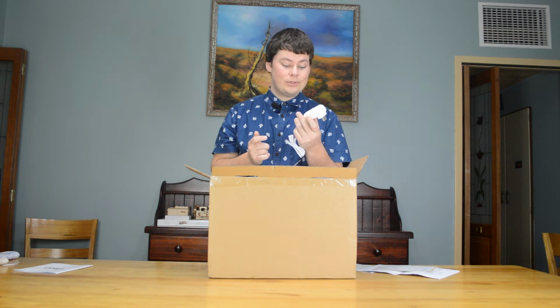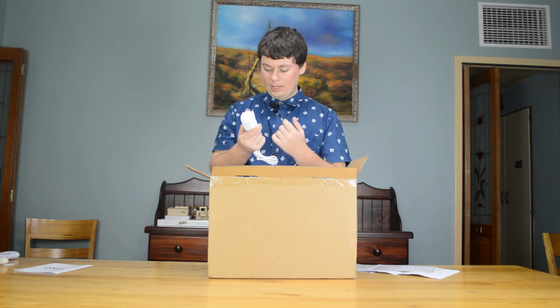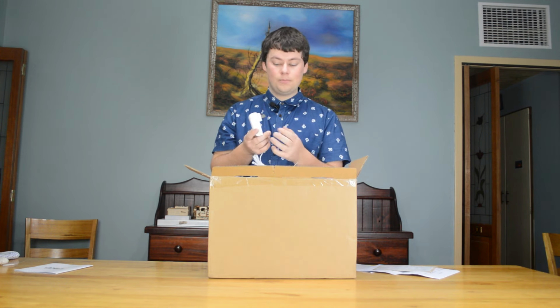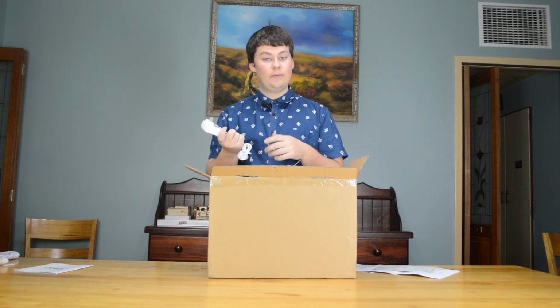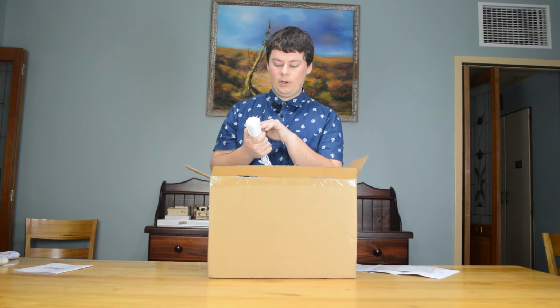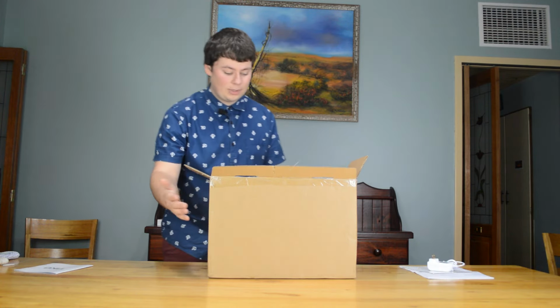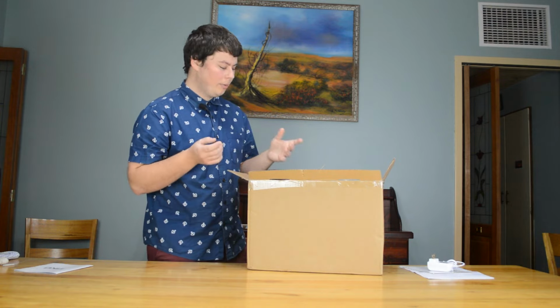So in terms of specs on the power adapter, it is tiny, let me just say. Input is AC 100 volt to 240, which is really cool because it means that even though it is an American plug, it does work on Australian voltage. And then it outputs 12 volts at 2.5 amps, which is tiny for a 3D printer. I still can't believe that it runs so well on such little voltage and amperage. It's crazy.